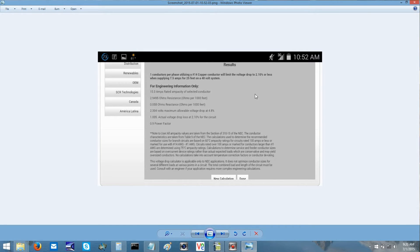Where if you're running 12 volts, to keep your voltage drop low enough to adequately power that device, you have to run a 3-aught wire. If you're going to design a system and you don't mind using this monstrous wire all over the place, that's fine. But smaller wire is easier to work with and it's much cheaper. If you go to your hardware store and price the difference between 3-aught wire and 14 gauge wire — 25 feet each direction, 50 feet total for two conductors — you're going to spend a whole lot more money on the heavier wire.